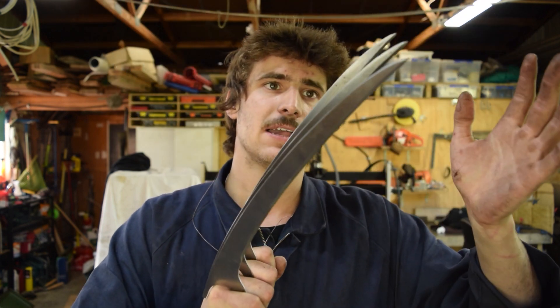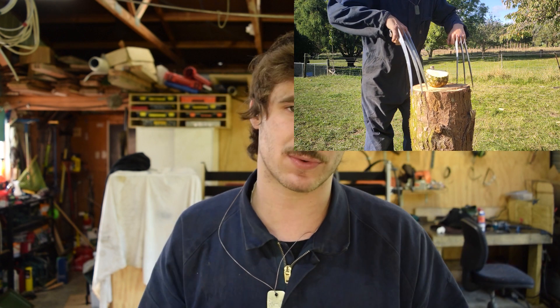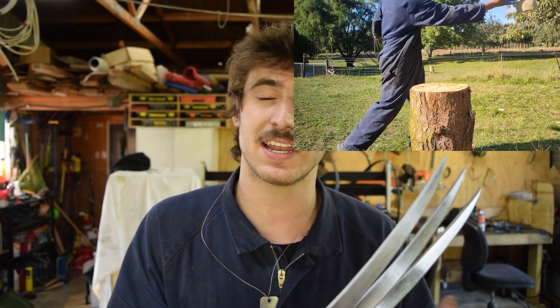The Wolverine claws worked fantastically. Talking about the design, I would custom fit each claw to my hand and go through CAD to do it all that way, rather than trying to do a generic size and then cutting each one to fit - it took a very long time just to get these to fit without causing pain. This little bar at the bottom does make a huge difference to reduce the leverage forces, but you're still dealing with a 30cm long pivot point, which is quite a lot to resist with your palm - so they will swing back into the back of your hand and hurt. The palm piece does let you jab, which means we can jab into bits of wood and that worked quite fine. Overall this is a very ineffective tool, but these were actually designed for my brother so they're just going to be hanging on the wall to look pretty. I just thought it would be nice to make them like adamantium.